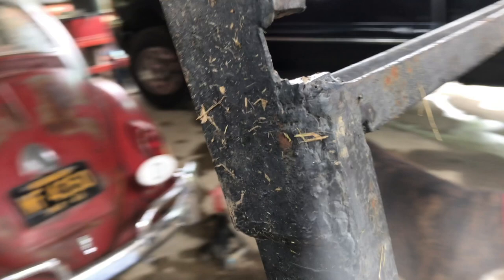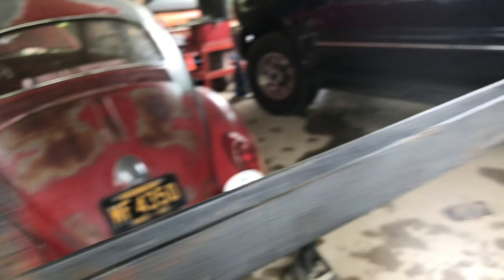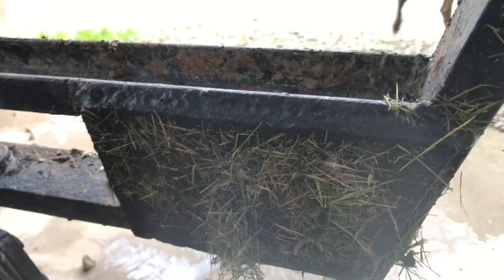And get some armature made for it. It looks like there may have been a repair here as well — kind of hard to tell if that's factory or if that was repaired. One of the other things someone did is put these heavy-duty plates down here — that is welded in, and that one is welded in — just to add some weight. So it keeps that trailer wheel from hopping when you're going down the highway. If you have just a little bit of weight in it, it helps a tremendous amount. They've just got those plates welded into those holes there.